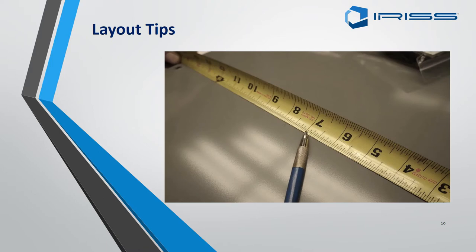This is probably the most important area of fitting an EMSD: you must ensure the EMSD is fitted correctly and in the right field of view. There is no point putting it lower than it needs to be, because once the panel is put back and you look through with your infrared camera you will not see what you want to see. Ensure that you put your window in the correct area on the panel.